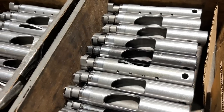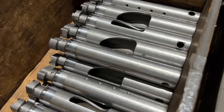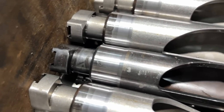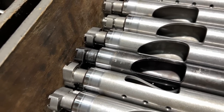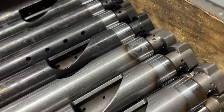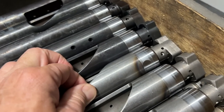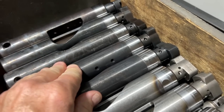I'm glad I finally got to do this — I've been wanting to do it for a long time. Tempering back the hardness to see if it would get rid of that crazy super hard part that the welding did. This is a great illustration of the tradeoffs we have to deal with in manufacturing. The inserts were only lasting between 4 and 7 parts — terrible. But those inserts are about $30 and they've got six good edges on them, and they take two minutes to change out, though you do have to run the parts slower. Is it worth it to spend an hour in our little oven for probably 20 parts tops? It's probably worth it to just run it the way we've been running it with them super hard and kill the inserts, since they aren't that expensive and don't take that long to change.